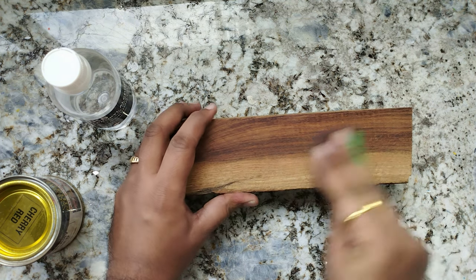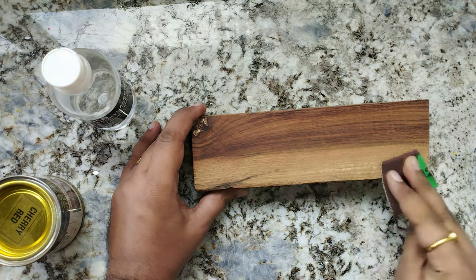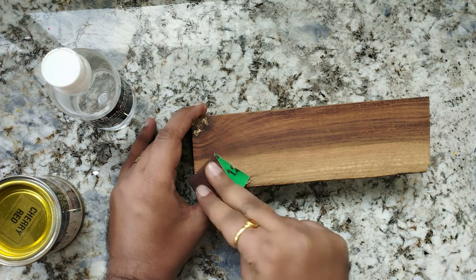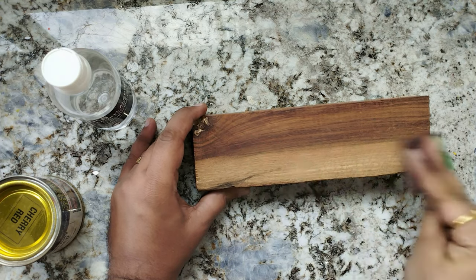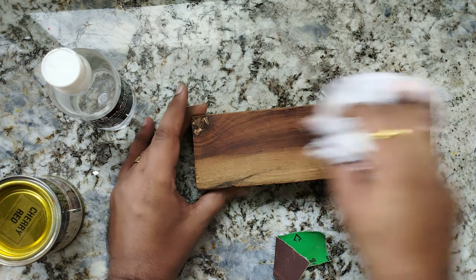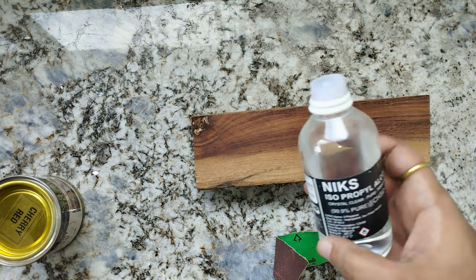To properly clean wood after sanding, employ the assistance of either a painter's dust brush, a blower, a clean rag, a tack cloth, mineral spirit, or denatured alcohol. You could also choose to use a combination of some or all of these materials before applying paint, varnish, or stain to the surface of the wood.